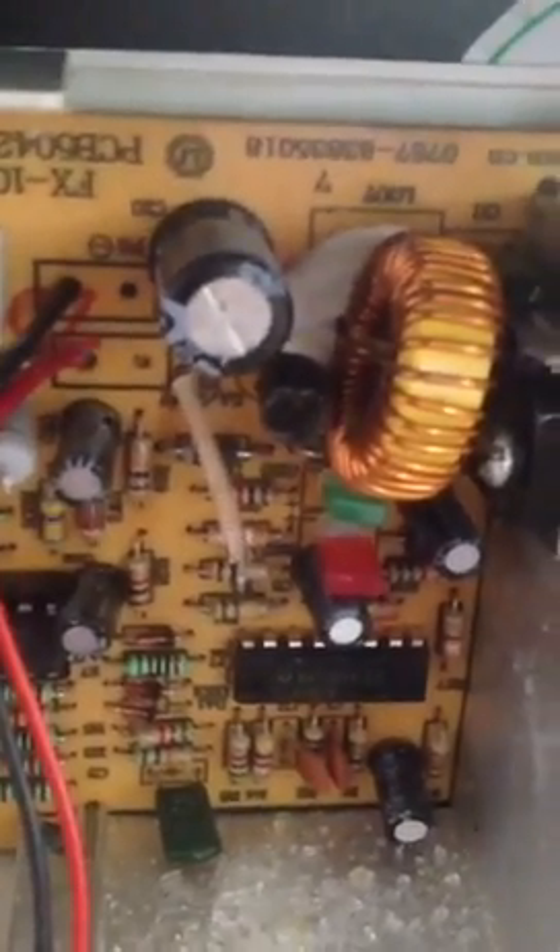You can see how I broke off the fuse. What I'm gonna do now is actually just bend this a little bit up and stick it right inside that hole — just like that. That's the final product. Throw a little solder inside there. Let's plug it in and see what happens.